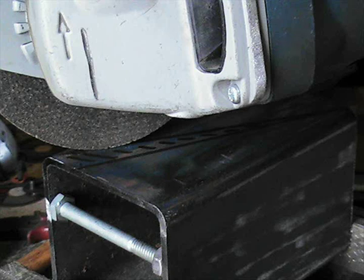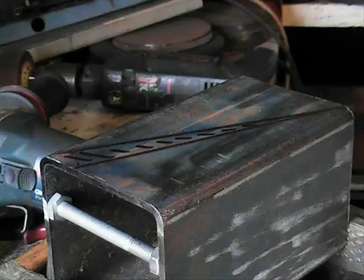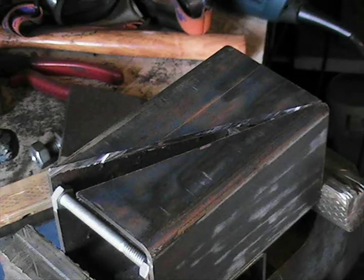For most of my metal cutting, I prefer to use a good quality 1mm cutting disc fitted to an angle grinder. With practice, you can achieve neat and accurate cuts, but be aware that when cutting along a tube, it will spring inwards and grip the cutting disc, causing considerable damage to the disc and rendering it useless. To prevent this from happening, I either use bolts and nuts or wedges to apply an outwards tension.